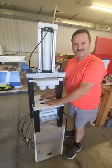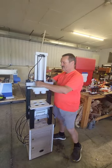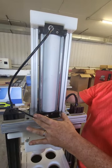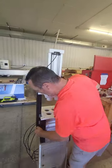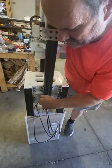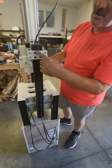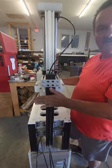Put a new mold plate in. Adjustment-wise, there are four screws on the back and the same four screws on the front — loosening those black screws allows the assembly to slide side to side. On the side there are four screws on each side that go into the side rails; loosening those allows the assembly to slide front to back.